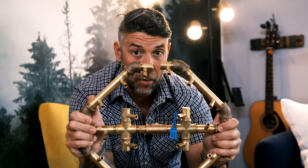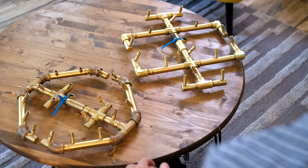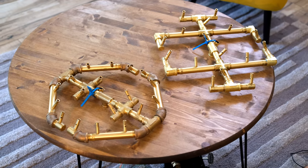The improvement was simply to take that and put the same amount of BTUs in just a tighter footprint — to make it more round, to make sure all of the jets are pointed in. Voila! You have the 180,000 BTU octagonal burner. It's a lot of power packed in a smallish footprint.